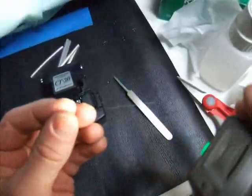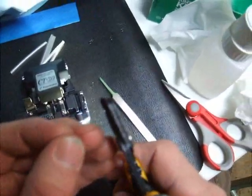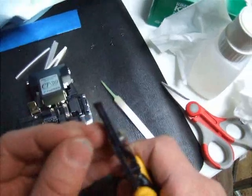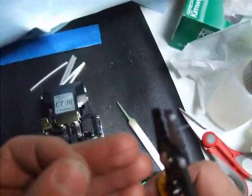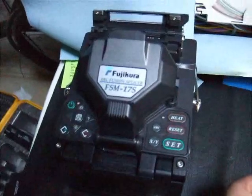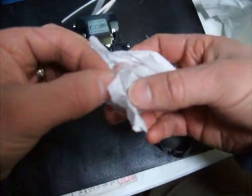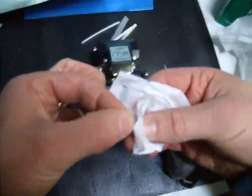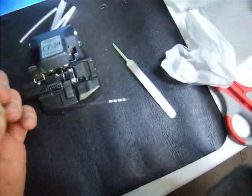Here's my second fiber. Take the strippers again — I'm just eyeballing this in. Doesn't matter if I strip off slightly too much. Generally run over it twice. I haven't broken a fiber yet. It's telling me it's turning itself off, and that's fine because you guys can see how it starts up from scratch. I spent a little bit of time setting up this camera so it timed out its sleep cycle. The fiber — nice and shiny at the tip. You can see the fiber is basically the same size as the buffer tube — very small buffer tube.